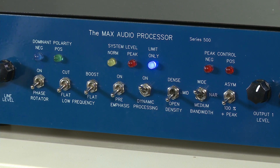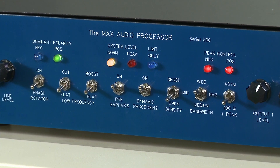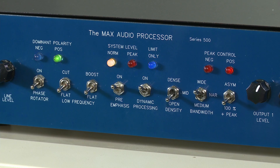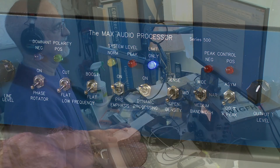If you further adjust the pre-emphasis switch, that's like a treble boost. It can sound kind of shrill into a local camera like this, but what it winds up doing is compensating for receivers that have inadequate passband, or those little desktop speakers that are only 4 inches around and don't have any high-end to begin with. So that can really help your audio quality to have the pre-emphasis turned on.